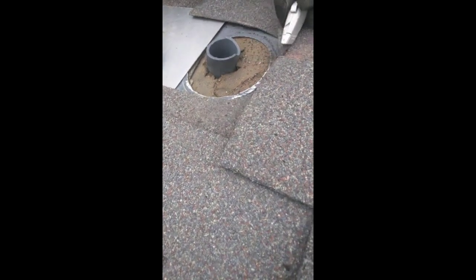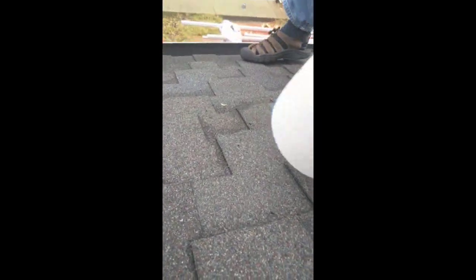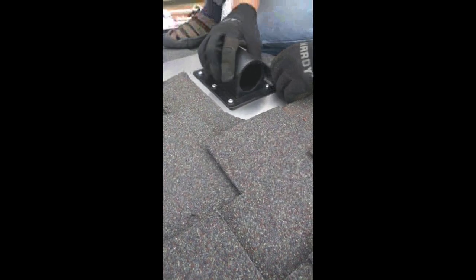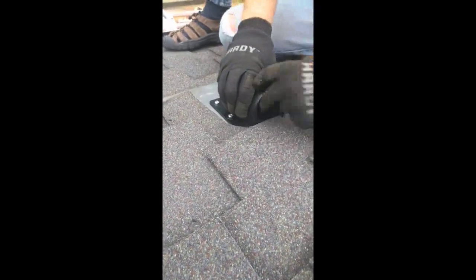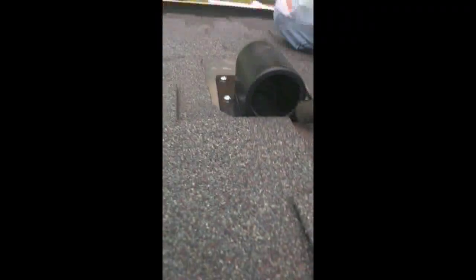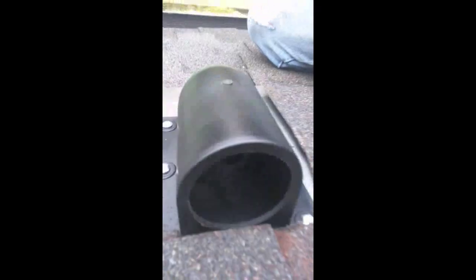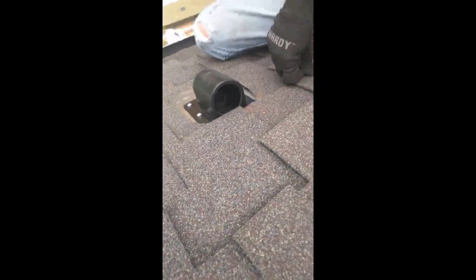Generally with this composite shingle you don't have to cut all the way through — you just score it and then break it. Once seated, you can actually see the sealing gasket sealed against the one-and-a-half-inch pipe. You can also see that little broken section that snapped off when I was cutting, but it's well above the gasket so it's not going to be a problem.